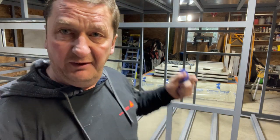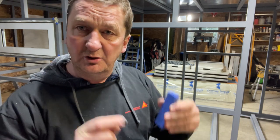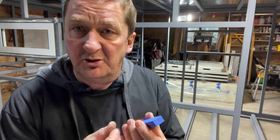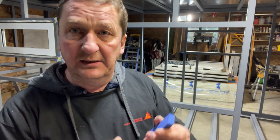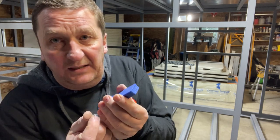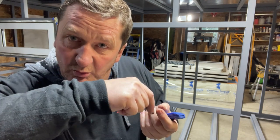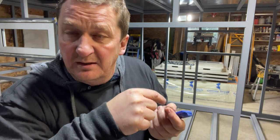It is very, very important that if you have a steel structure and you clad it with aluminum, the steel and the aluminum must not touch each other — they should not come in contact. Why? Because it will cause galvanic corrosion. I won't explain it in full detail — you can Google it — but it's basically an electrochemical reaction between an active and a passive metal. The electrons from the active metal transfer into the passive metal, weakening the active metal so it starts corroding. You see it when you use steel screws going through aluminum — around that screw head it's all corroded, even though aluminum can't rust, but it will corrode.